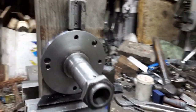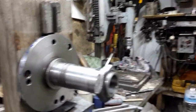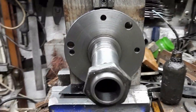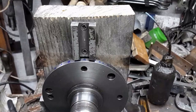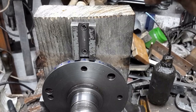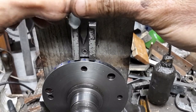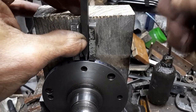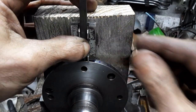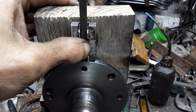I made this jig to punch the degree scale on the backing plate. It is not necessary on a dividing head, but it's still nice to have. This punch guide is for two digits. The center mark on the punch guide is aligned with the mark on the backing plate. In the case of single digits, the punch is located in the middle of the guide by means of two spacers.